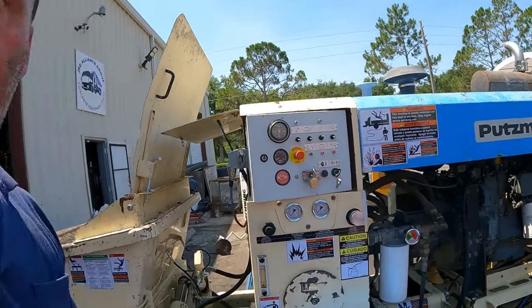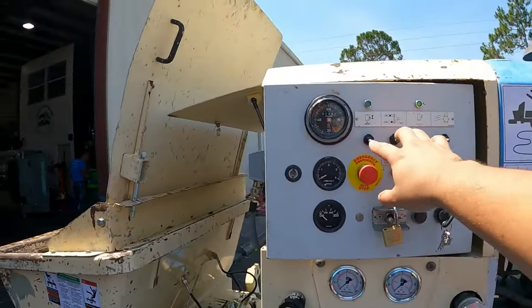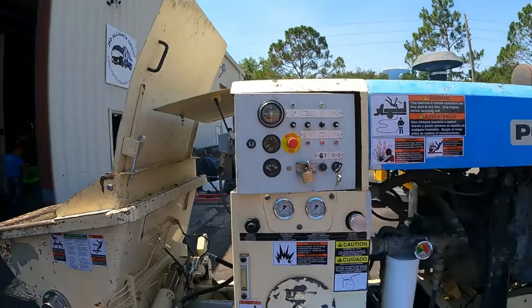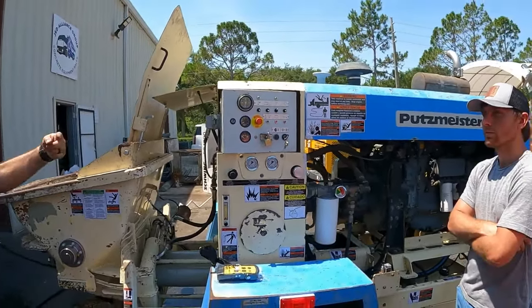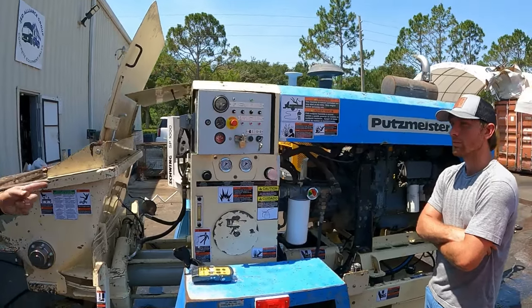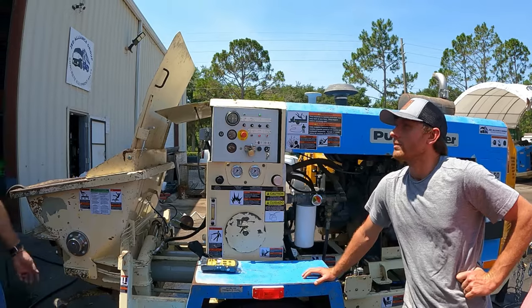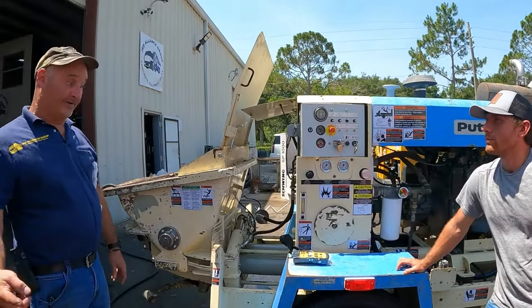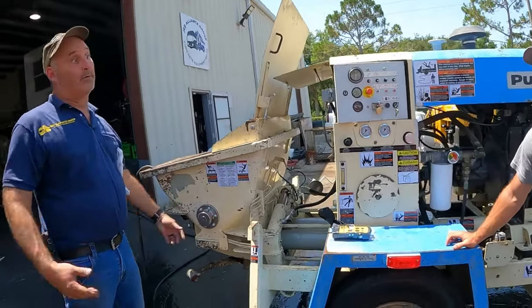And in order to not damage the machine, you have to turn the pump off, do the switching, and then turn the pump on again. Right. Because all you're doing every time on the forward reversing valve is moving the spool. If you went from forward to reverse while running, you would shove that spool as hard as you can against the other side with working pressure. It's about maybe 5 bar or so, about 100 psi, but it's enough to jam it, and it'd be stuck in reverse until I get in there and dig it out or replace it.